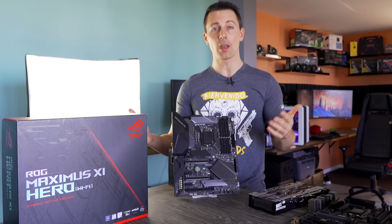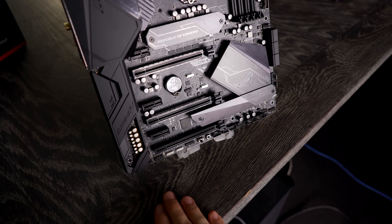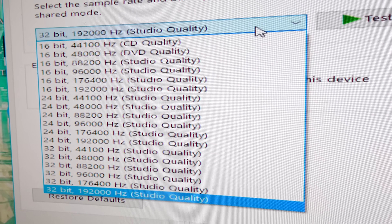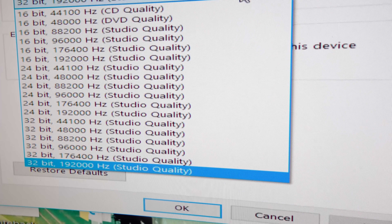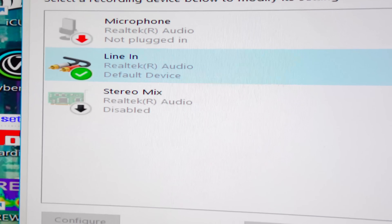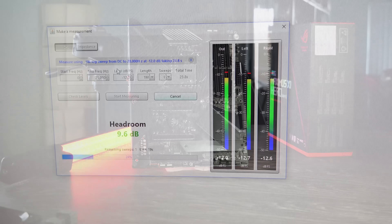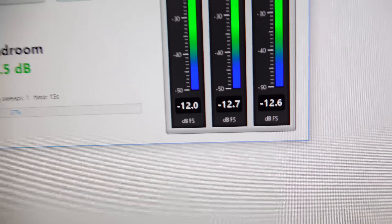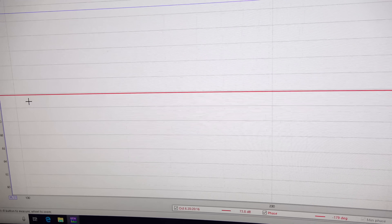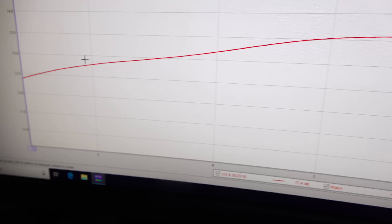Moving on to the right of the board with the Supreme FX Audio solution — a lot of you tell me you love the audio testing done at Tech Yes City. Analyzing this solution, they've got a 192 kilohertz 24-bit ADC implemented, and for the audio out, a 32-bit 192 kilohertz solution. When testing the frequency response curve in the range normal people listen to, the roll-off below seven hertz was only about 1.4 decibels, and the frequency response curve after that was incredibly flat. This is a phenomenal implementation of onboard audio.